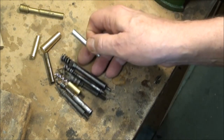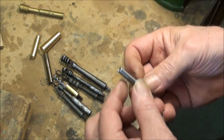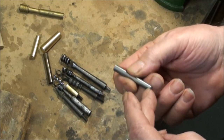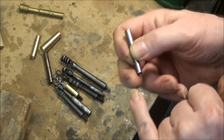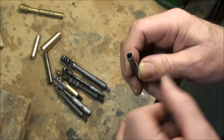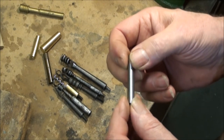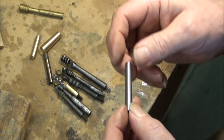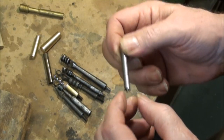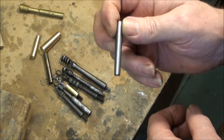And this one is one that's available from Jim Chambers right now. This one is kind of cool. It's a longer 2-inch long tapered threaded on the small end and fits about a 5/16 rod on this end. And of course you would pin this in place, and being tapered as it is, it fits down in your rod channel very cleanly and quickly, so it guides itself in. And this is very, very similar to what I see in a lot of originals.